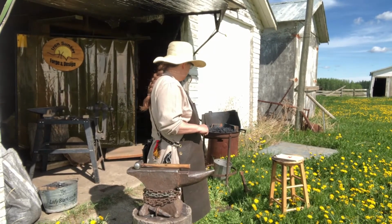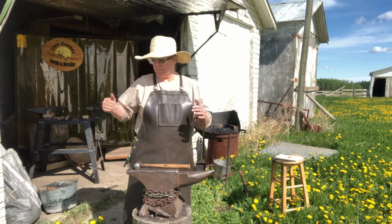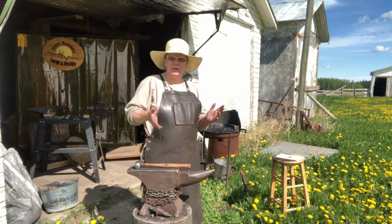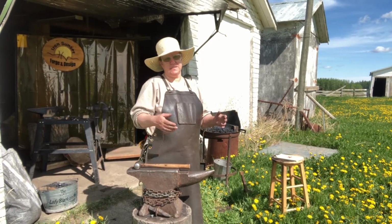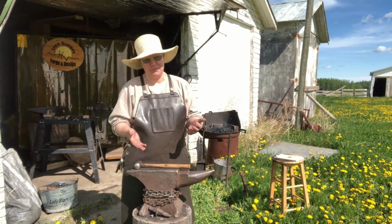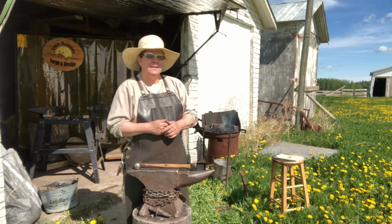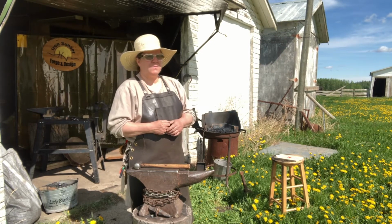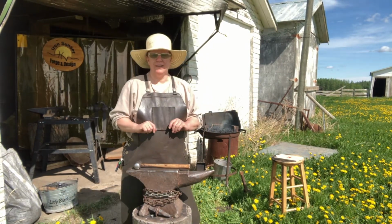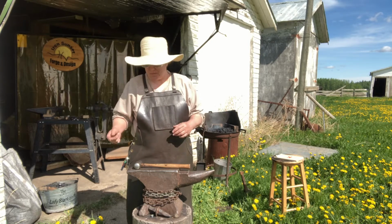And also, it's important to make sure that you also have a safety line if you're going to be at an event. I'm a strong believer about safety lines, because you will get people who have never seen a blacksmith, who've heard about them, but have never seen them and not understand how dangerous this is. You are portraying an actual trade. People have died from this. So let's not reenact that part. We don't want people getting burned accidentally because they don't understand that metal gets dark at 500 degrees Fahrenheit. Things like that. We don't want them to get accidentally, you put a hot piece down on the anvil, you're not touching it because you know it's hot. Somebody comes up and actually touches it. Yeah, that's a first aid day. We don't want to have to do first aid class at the same time.